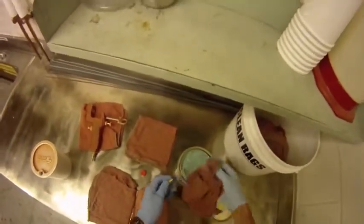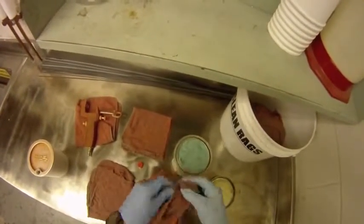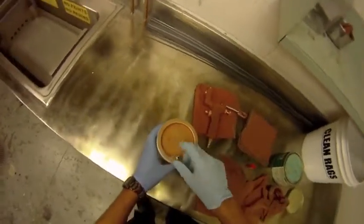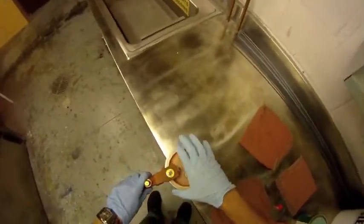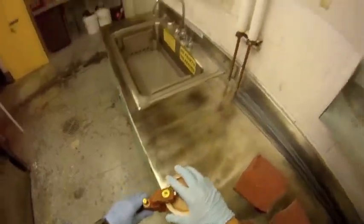After the nozzle is waxed, locate the lid of the cup and securely press the lid on the top of the cup. Then screw in the nozzle to the top of the lid. With the cup upright, locate the nozzle to the bushing of the gun, then fasten with the pull ring to the bottom of the cup edge. Make sure the cup is upright at all times or the gel will drip at the end of the nozzle.